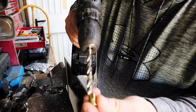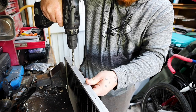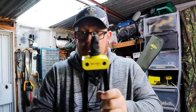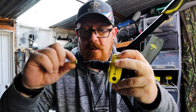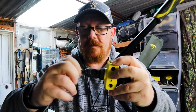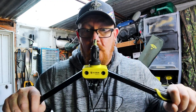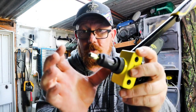Make sure your drill bit is the same size as the rivet nut so when you put it in it will be a nice snug fit. The rivet nuts go onto the tool — you open it up, on the end there's a thread, you take your rivet nut and screw it on. You then put that piece in the hole and push them together, which pulls it in and squishes it. Let's get them in and squished in!